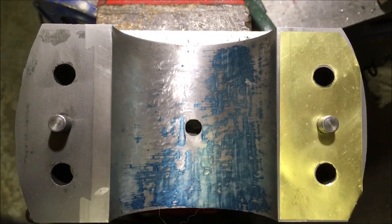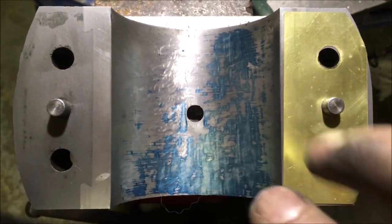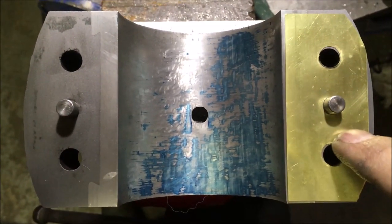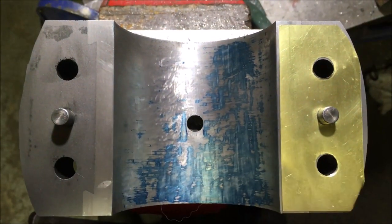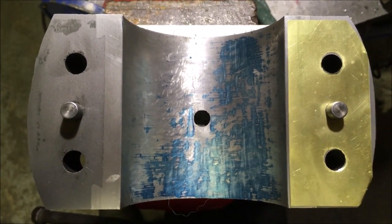So that's had about, I think it's 8 or 9 cycles now, and you can see it's progressively moving that way as the alignment comes in. I'm down to 3 thou shims, so if you like, I've took 3 thou off this position. I've probably got another 3 to go from 8. So no, I've took off 5 thou.